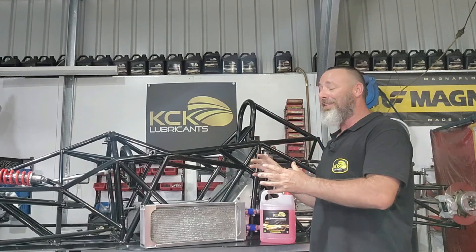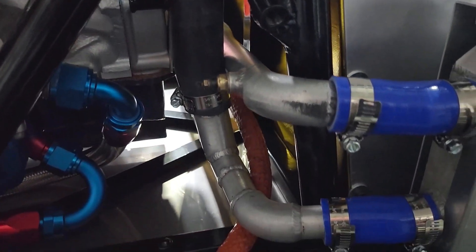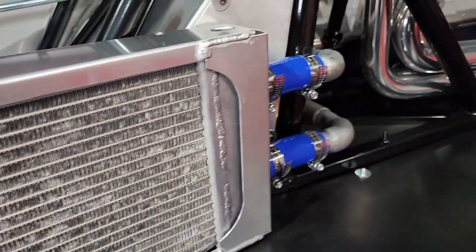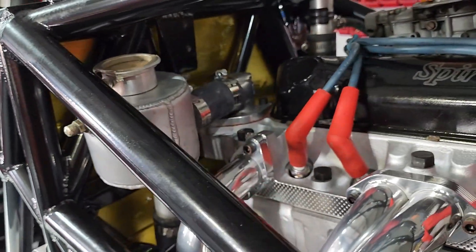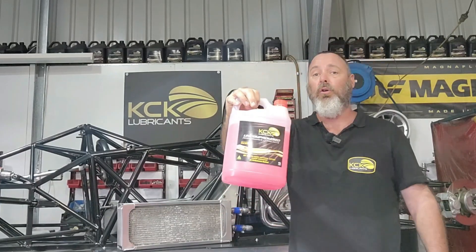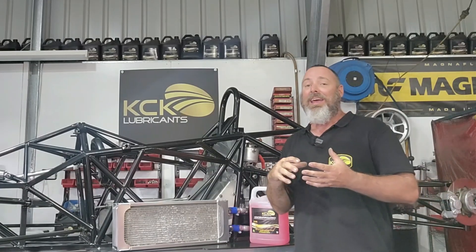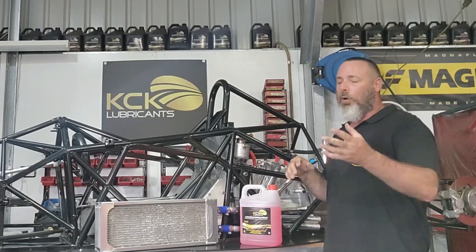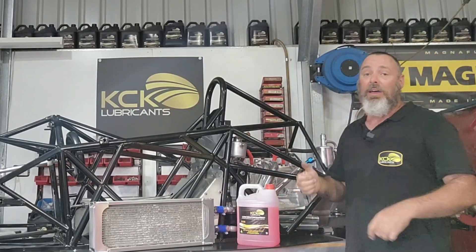The entire cooling system is now fitted to the car. Everything's in there — I've gone through and tightened all the clamps up, made sure there was no stress on any of the pipes, no push or pull. Everything was as relaxed as it could be to prevent any failures, whether that be the mountings on the radiators or a pipe cracking. The coolant we're going to use is the KCK All Performance Coolant — it's a long-life coolant and I never want to have to change this coolant again. Coolant on race cars is normally very neglected because it's difficult to change and makes a mess, but this can sit in there for years and still offer the protection, boiling point, and all the standard stuff you expect from a quality coolant. I'm going to fill this cooling system up — we're done for this episode. See you on the next one, and subscribe if you haven't subscribed. Thumbs up if you liked it. Thanks for following.